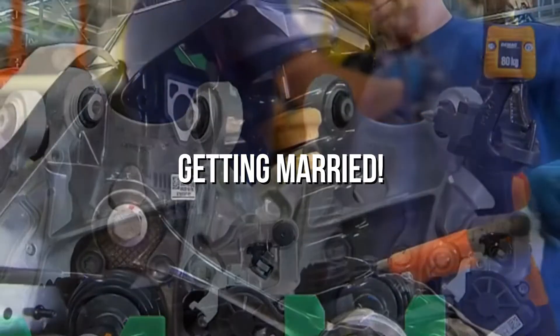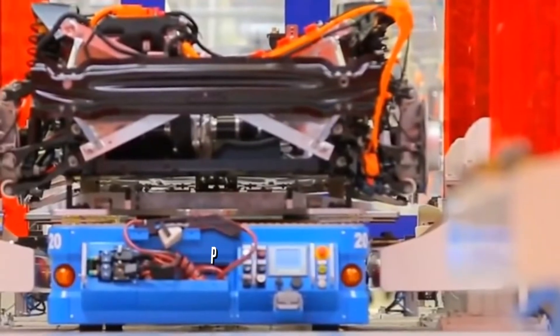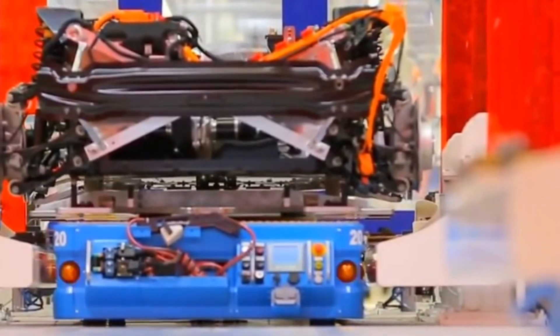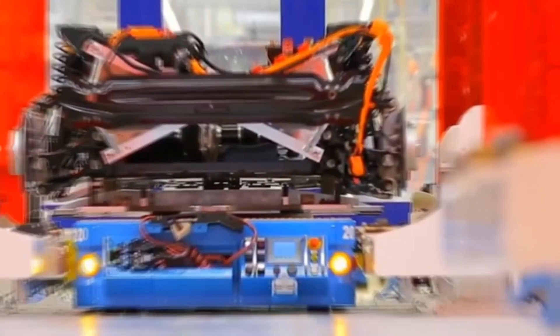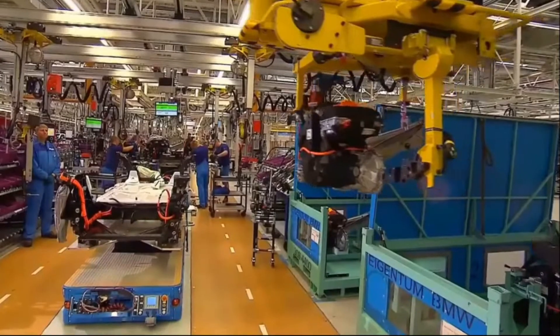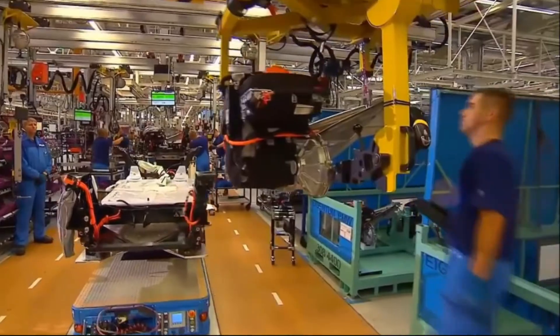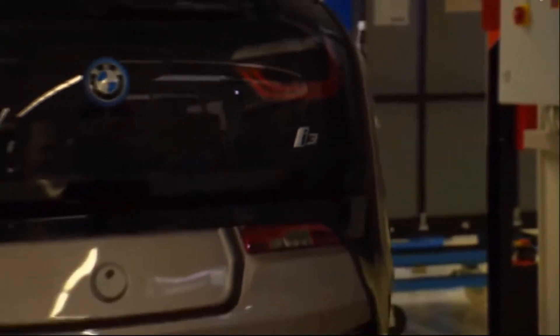In the eighth stage, the battery pack is attached to the powertrain — a skeleton with all electronic parts attached. This also includes attaching the power brakes, which are left covered with a protective layer to avoid any damage, as the cost to fix them is high. After the battery pack and powertrain are attached, they are sent for marriage in the ninth stage. In the marriage stage, the integration of the powertrain and battery pack is completed and interiors are fitted. Fitting an interior mostly includes placing the seats covered with a cushion cover. The emblem or logo of the company is carefully placed at this stage.